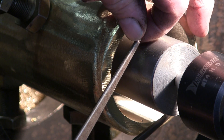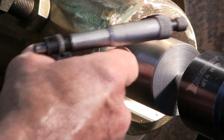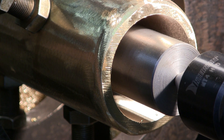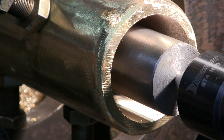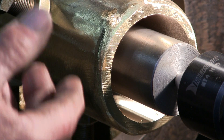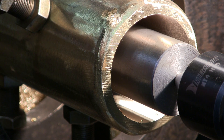I've reached in and got the diameter — this is the minor diameter of the bore. There are two steps in the bore here. They want this one down to three inches, and we're at about three inches nine thousandths. The other one, the very first one, came in at about three inches two thousandths — that's just water clearance. They wanted to hold that diameter close to three inch, and then they're going to bore the step for the bearing at three and an eighth. So we're going to come around to the other side and start setting up our tool bit to bore the straight diameter.